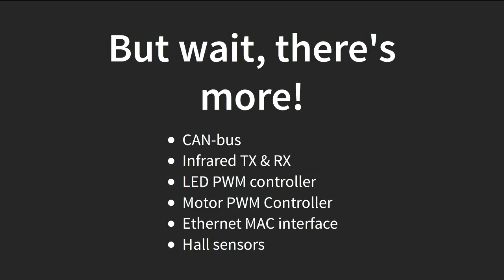This is starting to sound a little bit like a late-night television spiel, but there really is more. There's a CAN interface for automotive connections, and an infrared transmitter and receiver — designed for talking to televisions and sending IR remote codes, but it's really an engine for sending any stream of digital on-off pulses. Someone has already used that remote control interface to drive NeoPixel WS2812 LEDs, which is much easier than on the ESP8266. There are also various ways to make pulses for LEDs and motors, plus an Ethernet interface.